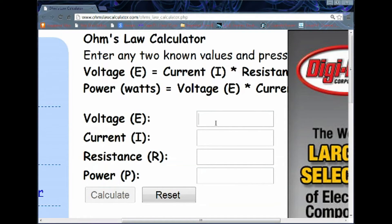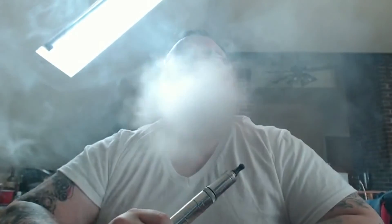Delicious. Just wanted to share that with you — that's how you do it. It's quite simple. Now you've got to use the right batteries — 18650s. I use the AW IMRs on here with no problem. You don't need the M&Ks for this build, not at all. Here's the calculator just to show you: 8.4 volts and we're at 0.4 ohms — so we're looking at 176 watts and 21 amps in total.